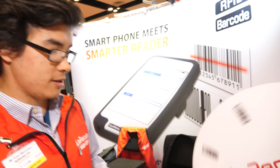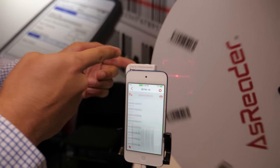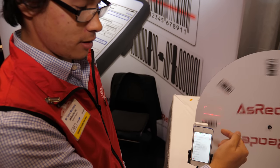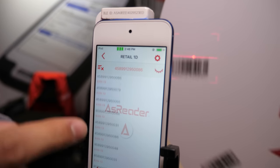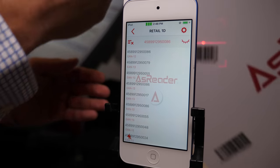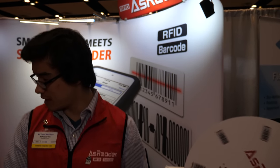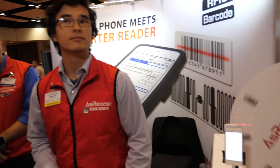So what does the laser do? The laser is just a generic laser and it is aligned with the camera of the phone so you can align the barcode and read it. The actual barcode reading is done by the camera on the phone. But having the video running like it is right now uses a lot of power, so we have the option to actually turn that off — just see the data — and then you don't have to line it up visually. You just need to line up the laser, you don't even have to look at the camera. It saves a lot of power. So the laser is just about pointing to the right place, and the camera is taking the barcode, using the application on the phone to decode it and send it to whatever application you need.